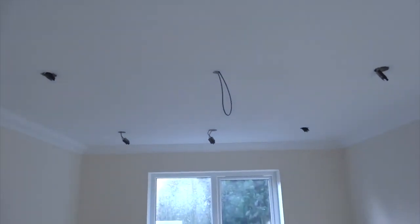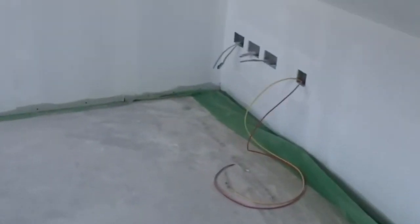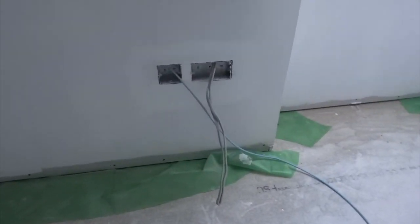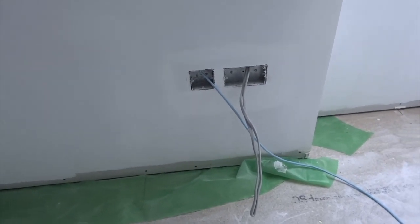There's another PIR in the ceiling here for control. So as you come in from the garage or the back door or you come downstairs, that will trigger the lighting for this area. Got a light switch just here. And as we head upstairs, we've got a couple of small rooms. Basic landing and then if we take to the left, we've got a small office — pre-wired again for push button light switch, audio control, a couple of voice data points, and CAT6A added later so we can have an additional feed from the video matrix up here if we need it, along with in-ceiling speakers.